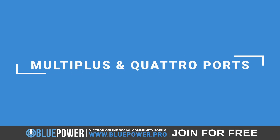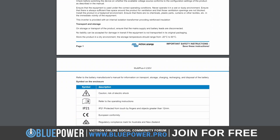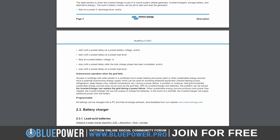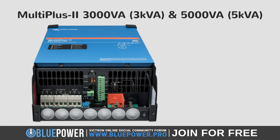With that said, let's begin by doing a quick refresher of the MultiPlus and Quattro connection ports for clarity's sake, as the models do differ slightly in their features and layouts. I will be covering most of the differences here, but make sure to refer to your manual for the correct location of each component and port. Here's the connection overview for the Victron MultiPlus 2 230V 3000 and 5000VA models. On the far left is the AC out 1 port, where all your essential loads should be connected.